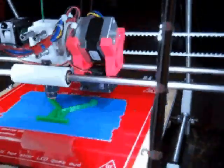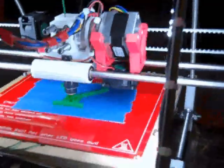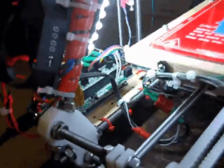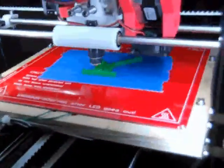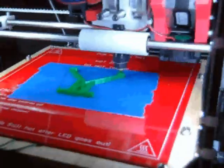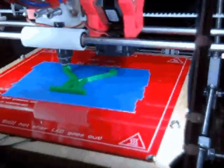I may just cut this video here in just a minute, but I wanted to show you about the spares. I'd recommend both of these: the Pololu driver if you've got the Maker Gear kit and you're using the RAMPS 1.4 cover board for the Arduino, and also a spare hot end. I've been on the IRC chat and there are many people having trouble with their hot ends. It wouldn't hurt to be able to, within ten minutes, drop in a new one and go from there.